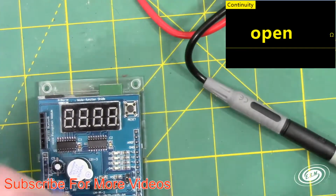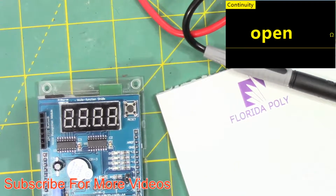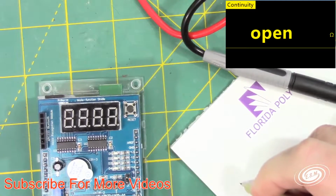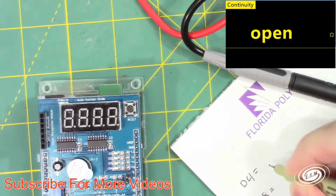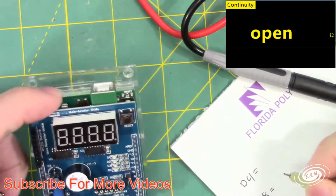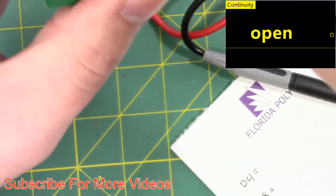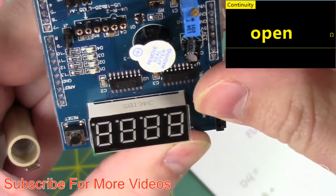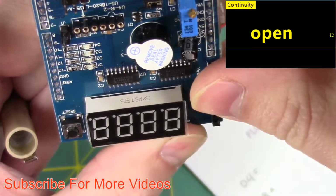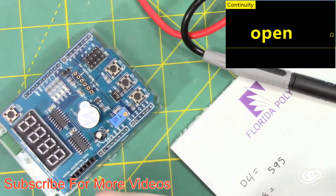So I'm going to write that down. I'm going to put this jumper back on here. I'll write this down on my Florida poly pad. So D4 and D8 go to, what chip is that? See if we can see the chip number on there. 74HC595. So it is a 595 shift register. 595. Okay, well,